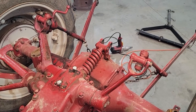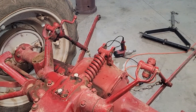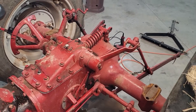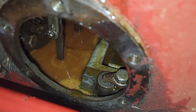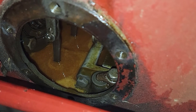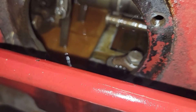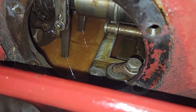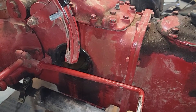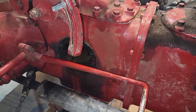That's just at idle. It picked right up and you can see them drifting back down when lowered. If it had an implement on there, it would go down quickly. Everything looks like it's working great. You can see over here on the other side, the oil level is just below that bottom bolt. I'm going to let it sit for a few days and use it a bit, then see where the oil settles. It may need just a little more oil added. So everything's looking pretty good - we'll get it put back together and have this tractor out this weekend doing some work. Hope everybody was able to use this video and get some help from it. Remember, you can't finish a project without getting started.